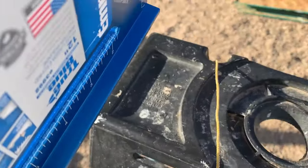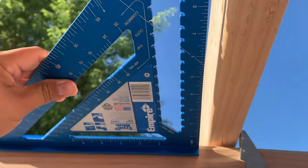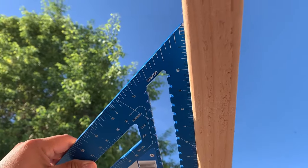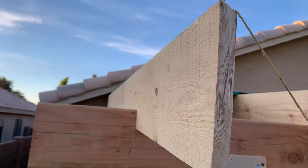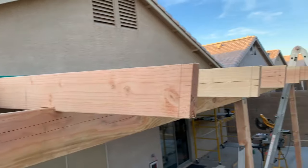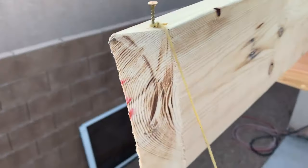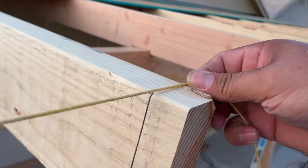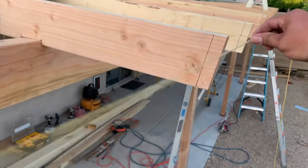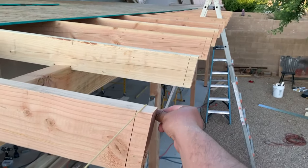We try many methods to get the rafter straight and square, but the 4x8 OSB boards ultimately determine the placement of the rafters. This one video is slightly out of order, but I wanted to show you how we prepare the rafters for the fascia board. The outer rafter boards, which are also the fascia boards, are cut at a 45 degree and a string is pulled between them to help mark the rest of the rafters to cut them. The fascia boards are 2x8.